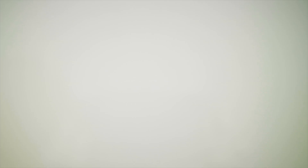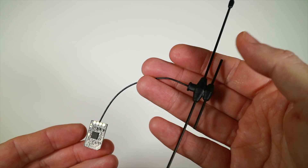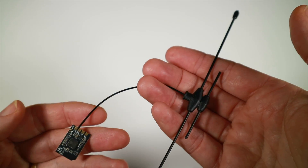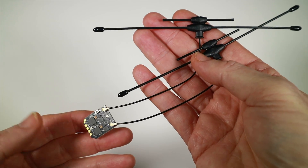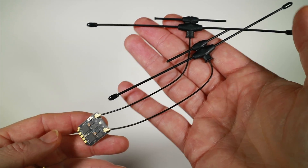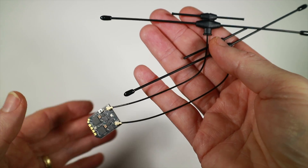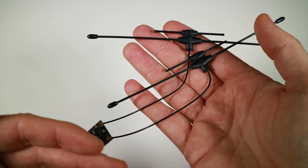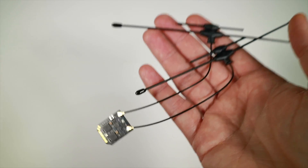As I mentioned, the XR3 isn't available yet, but try and imagine it as looking like an XR1 but with two antennas for antenna diversity. Talking of diversity, this is the XR4 — this has true diversity, meaning it's got two LR1121 transceivers and two dual band antennas. So you can make use of 2.4GHz or 868/915 in diversity, or Gemini cross band diversity where we're flying packets in two different frequencies and two different bands at once. That should make for an amazing link.